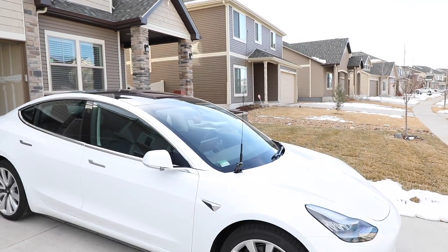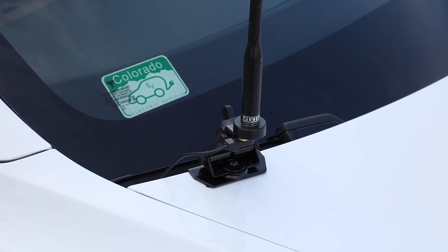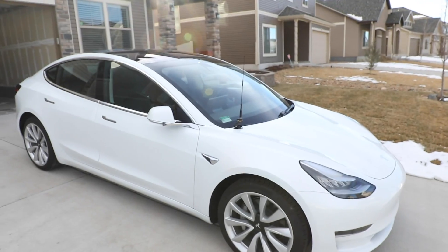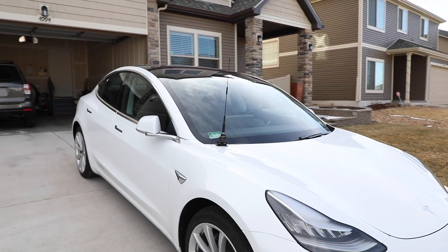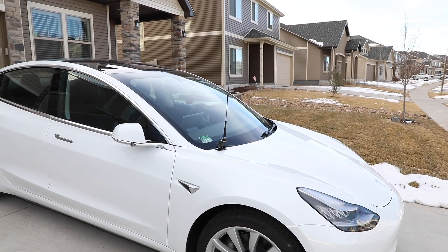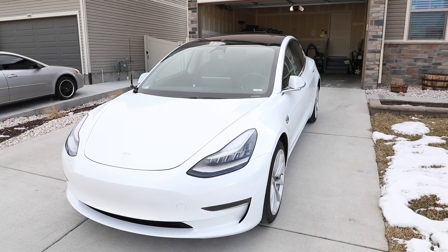We got the Comet SBB5 right here, and I do have another antenna. This is like full ham radio geek right here - I had this one on the car at the ham fest I just went to. I do also have the SBB2, which is much smaller and shorter. If I want something a little more sleek I can put that on the car. The SBB2 looks almost like it could be an AM FM radio antenna - just a bit easier on the eyes for driving around town. Most of the repeaters here in Denver are up in the mountains so it doesn't take much to get into them, so I really don't need a crazy long antenna for 70 centimeters and two meters.